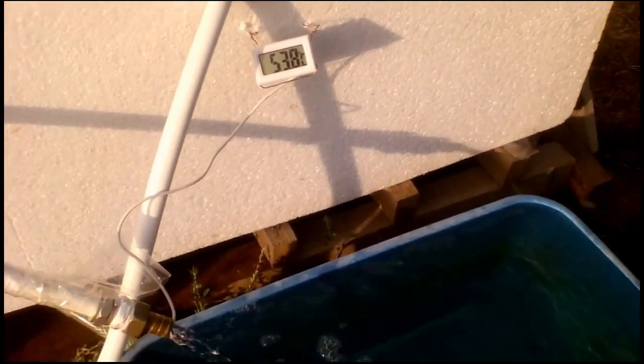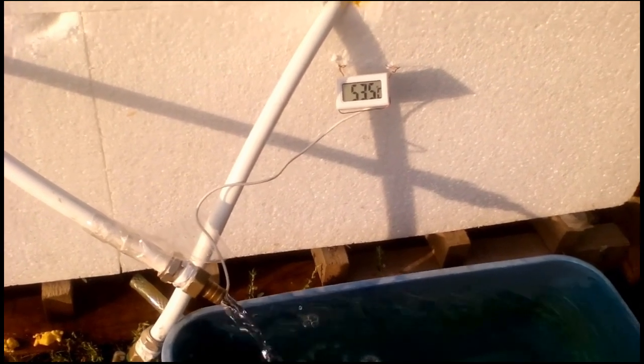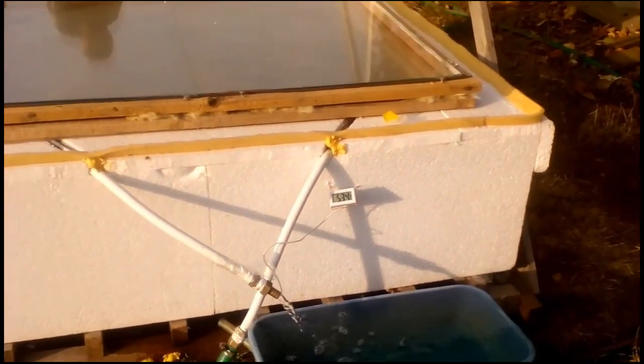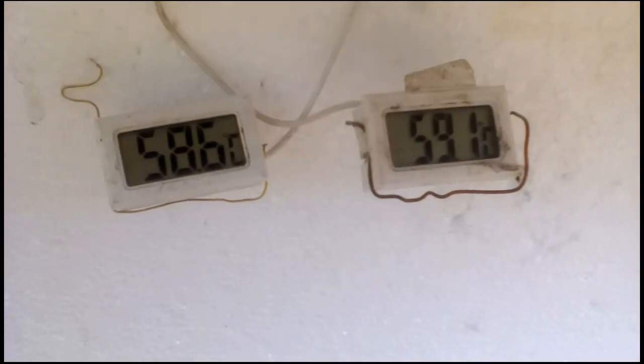This is a situation when my solar heater has already given 15 liters of water with a temperature between 70 and 54 °C. If these 15 liters mixed with cold water, you get almost 30 liters of water mixture with a temperature of 40 °C. After this experiment, the temperature of those 100 liters of water decreased to this level, and it is about 6 °C lower than it was before the experiment.